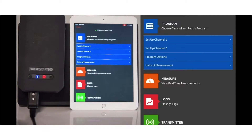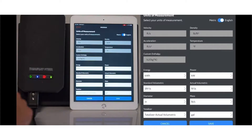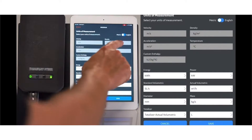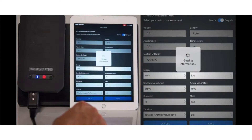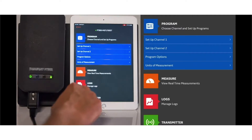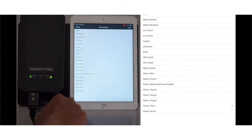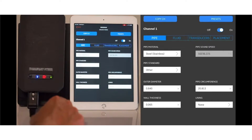As you can see, this is tablet-based programming, so people who are not necessarily familiar with the programming and setup of the system can easily click on the buttons to move through the menus to understand how to program the menu, set the measurement, and set up a data log — whether it's for a couple of days to a week — to make that key measurement and then take it back to the office to troubleshoot and diagnose the situation.